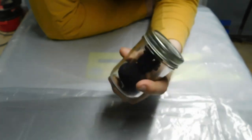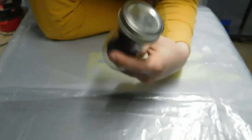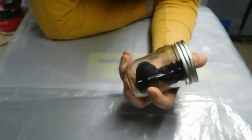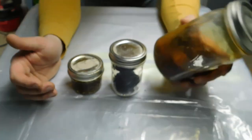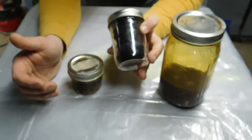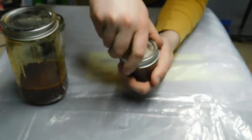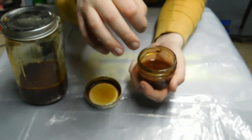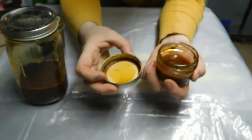I will usually use a pad for the entirety of one project. These are cheap enough that I don't have to do this every single session — I keep using it through the whole project and then won't make a new one until I start the next. This is usually the collection of jars I'll use: I mix my shellac in a one-quart mason jar, store the applicator in the pint, and pour a little shellac out into an eight-ounce jar so the applicator can reach in easily, just replenishing that as I go.